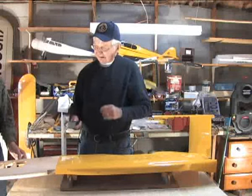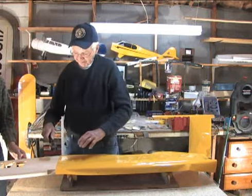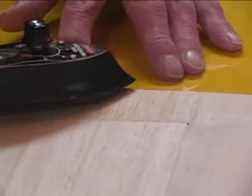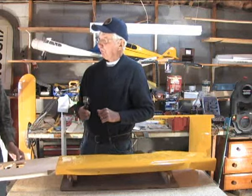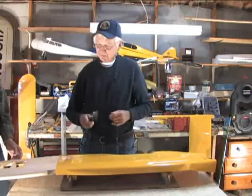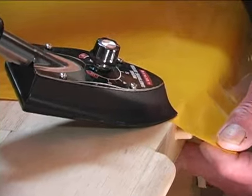What we're wanting to do now is to make the glue adhere to the wood, so we don't want the material to shrink. So I check it and see, and you touch, just touch. They call this iron-on material, but I call it touch-on material. When you iron the material, sometimes you'll iron wrinkles into it. Touching it and pressing it down makes it adhere better.